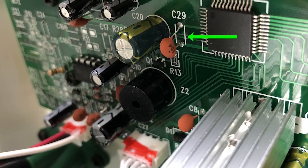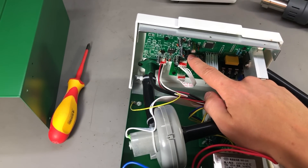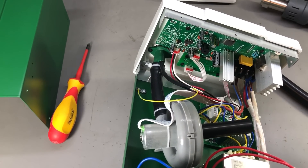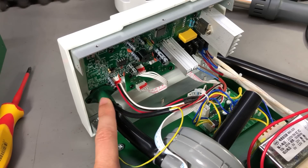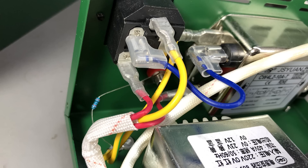It's funny how they used through-hole decoupling capacitors — they already had SMD components on this board, so it seems strange not to use SMD decoupling capacitors instead. Here is the annoying buzzer, and I'll have to place some double-sided tape over the opening to try and make it quieter. Here is the coupling with the exterior hose — we have a channel for the air and another channel for the wires going to the handle. Overall, pretty clean construction inside this unit with no major flaws; the only thing I would complain about is the grounding, where they soldered wires to the ground tabs over painted metal. I appreciate the use of a mains filter and the properly insulated wires with heat shrink.